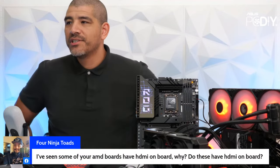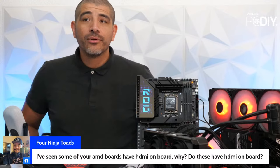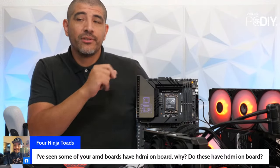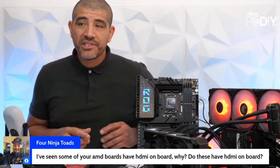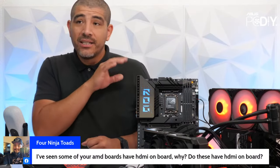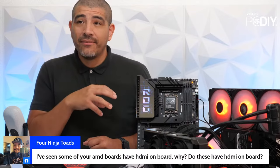Four Ninja Toads is asking, I've seen some of your AMD boards have HDMI on board. Why do these have HDMI on board? So you might not be aware. One of the things that transitioned from the AM4 era, so let's say if you had a 5600X or a 5950X or a 3600, AMD did of course have APUs, some of their CPUs that had integrated graphics. But unlike Intel, where pretty much all of their CPUs had integrated graphics built into them, the majority of AMD's CPUs did not have integrated graphics.